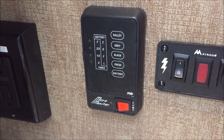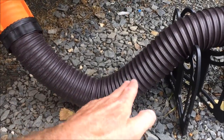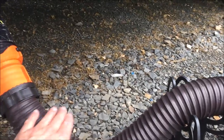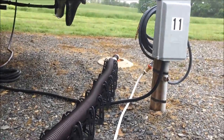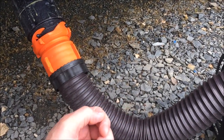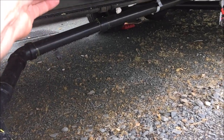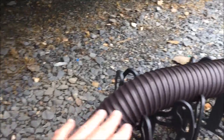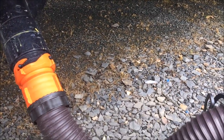I've got my drain hose with a slope in it — that's a trick I learned from someone else's channel. This provides a p-trap and leaves water trapped in the hose, which prevents sewer gases from coming up through the hose and into your RV. If I left my gray tank valve open without this p-trap, I would get sewer gases coming up through the drain in the sink and the shower.